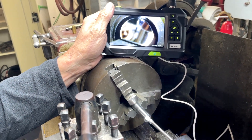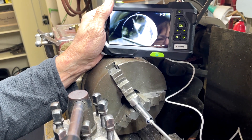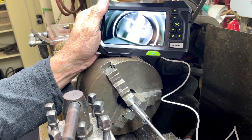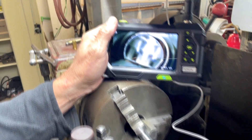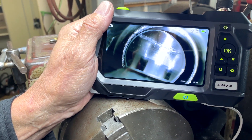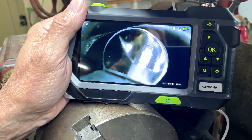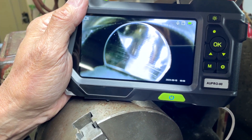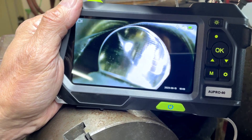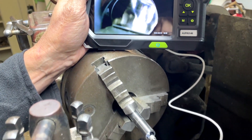I'm inserting the scope into the chamber now. You can see — it's like a mirror finish inside. You can see there's a little bit on the end that hasn't had the burnishing rollers over it — that's cut by the original reamer finish. When you come back and look at the burnished finish, it's like a mirror on there. And that's just from rolling the metal, not cutting any — it just rolls it all dead smooth. Quite remarkable.